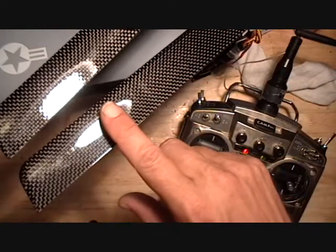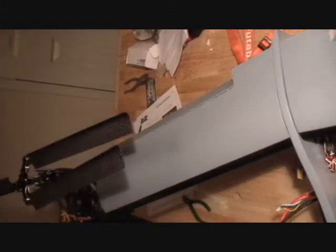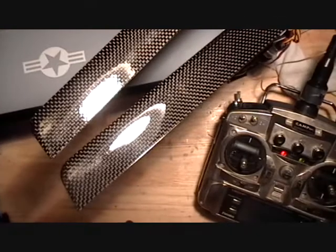And this left side blade set looks perfect. My right blade, you can see it over there, has a little bit of offset, about an inch. That's probably 2 turns. So I'll take my swash plate links, the 4 links that go into my swash plate, and I've got too much collective pitch, so I'm going to drop each one of those down 2 turns each.